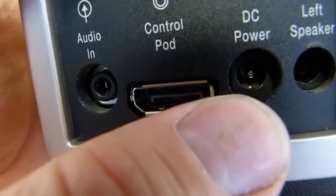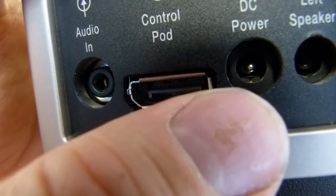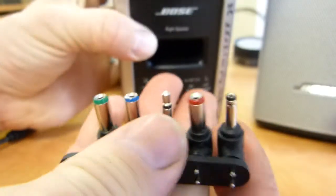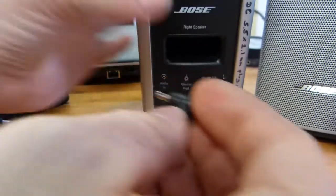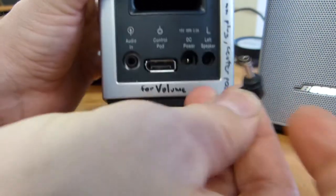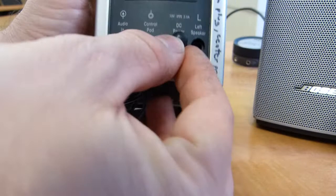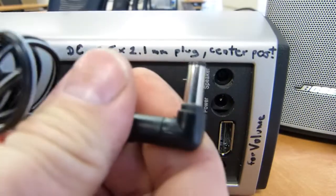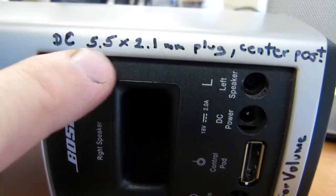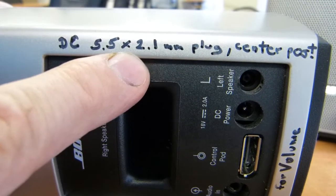You can see underneath the pin at the six o'clock position there is a metal tab that's somewhat shiny. So this connector needs to make solid electrical contact. It needs a little bit of experimentation to find which of these shapes will be the right one. In this situation, this is the correct size. It just so happens all of these barrel type connectors have a name and a size. So 5.5 millimeter by 2.1 — that's the name of it. Very self-explanatory and very unimaginative. That's the plug size that matches there.